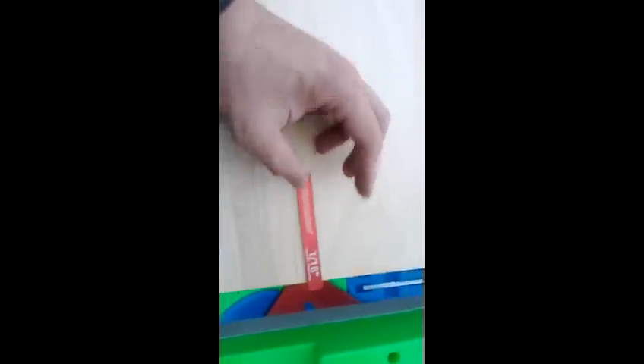I've now got the reference marks — here's the one at this end and here's the one at that end. But because the piece I'm taking off is so small — roughly three and a half inches — laying the track of the track saw on it doesn't quite work. You can see how most of the track hangs over. So I'm setting it up with the track on this side to keep the saw on the bulk of the wood. In order to do that, I need to offset the cut by the width of the blade. For that, I use this Woodpeckers 1/16th shim to reference right off the line and make a new line on that side. The blade is not exactly 1/16th — it's Festool, a metric size — but the 1/16th is close enough for a garage wall.